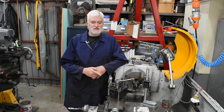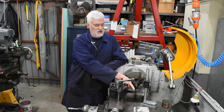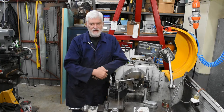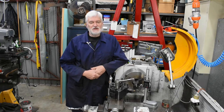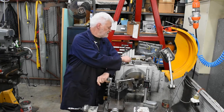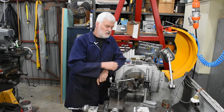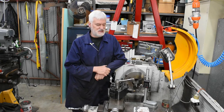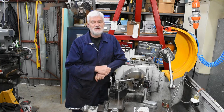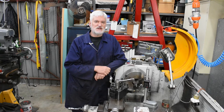So putting it all together and wrapping up: because this lathe is so badly worn in the ways and carriage, any attempt to set tool height working off the lathe bed or carriage as a reference source is going to be problematic, particularly when very close to the chuck. The methods that are going to work for me are the little spirit level gadget for bigger diameters and the rule for smaller ones. Don't use the spirit level thing on the side of the chuck. I think I can go forwards with an expectation of much greater consistency in my tool setting on centre height. I hope there's some stuff in there that you found useful — thanks for watching.